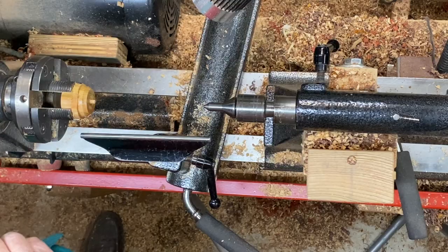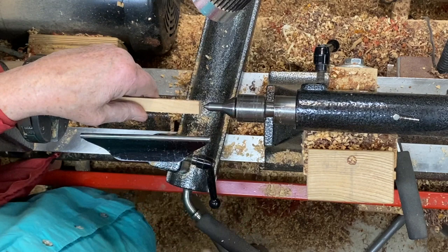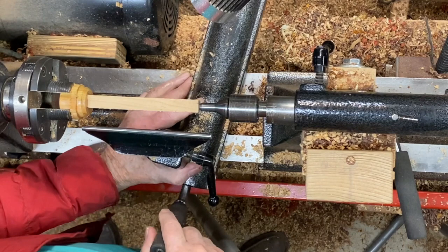Here's what we're going to make a bunch of. Here's the lathe set up with the jam chuck and the headstock chuck and the tailstock live center. Here's what we're going to do: a cone seated in the drilled hole. This keeps the blank perfectly centered on the holes you just bored. Align the tool rest with the lathe ways and make sure it clears the chuck.